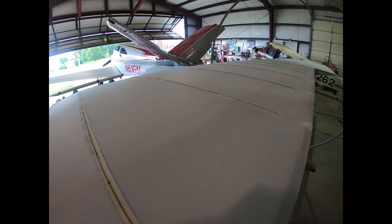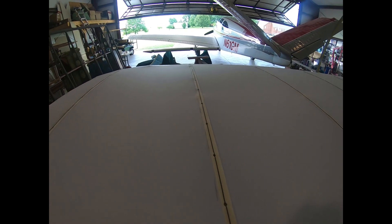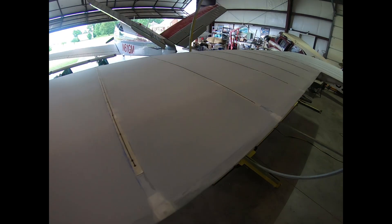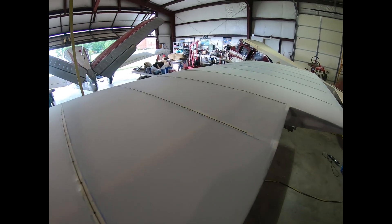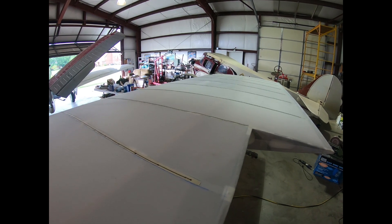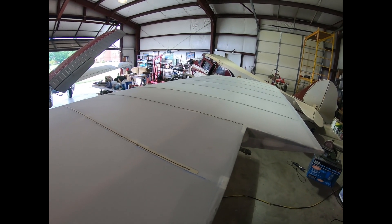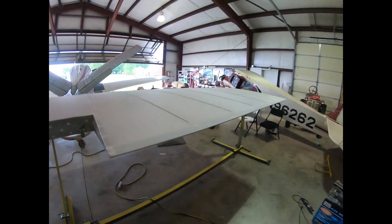I'm finished with the wire clips — this is the top of the wing. You can see each rib has the clip all the way down, and again that replaces rib stitching. I did one side in a couple of hours one afternoon and the other side in a couple of hours another afternoon, so it went a lot faster than tying all those knots.